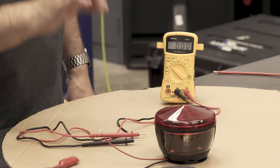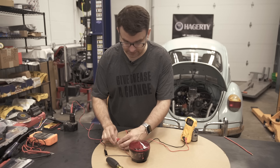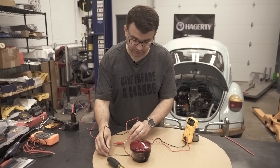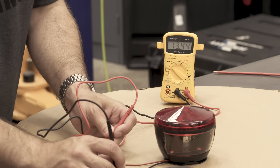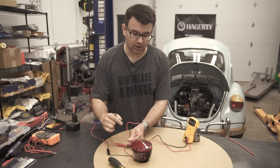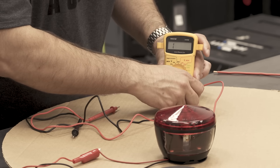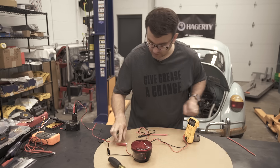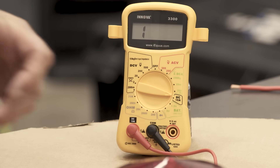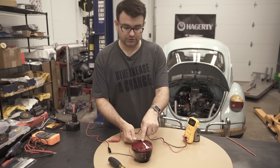For the sake of testing all three things we've talked about today, I've gone ahead and made our light bulb broken — it doesn't function anymore. We hook power up to it and there's no light. First we'll test voltage: we've got our voltage set back up, hook to the negative terminal and positive terminal — okay, so electricity is getting to this point in the light bulb. Next we'll test amperage to see if that electricity is actually flowing through the bulb. We switch over to amperage, move our terminal to the amperage terminal, put it in line with our circuit, hook it up — and it's reading nothing. That tells me this circuit is not completing, meaning there's something wrong inside the bulb.